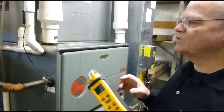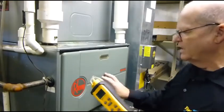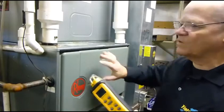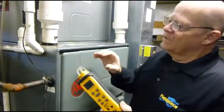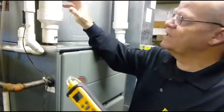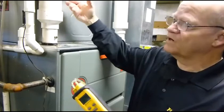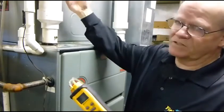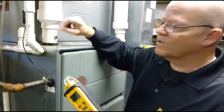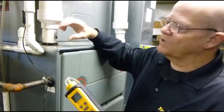When taking the measurement, it's ideal to be at least 12 to 18 inches away from the inducer. In this unit, the inducer is about right here, so if I tried to do it inside, I'd be inside the sealed combustion area, and I don't want that because I'm bringing in air from the outside. We've drilled a hole right here. From any fitting — like an elbow or a reducer — if you're downstream, you want to be at least two times the width of the pipe; for a three-inch pipe, six inches away. If you're before it, you want to be at least half that distance.